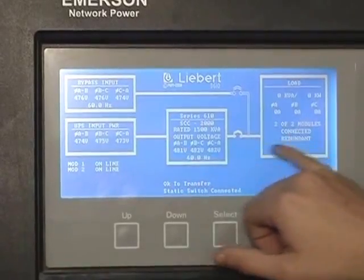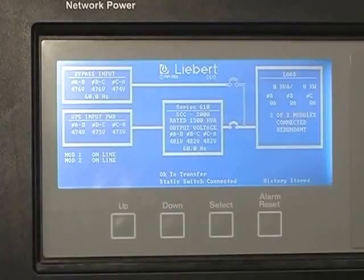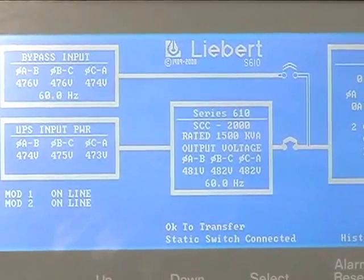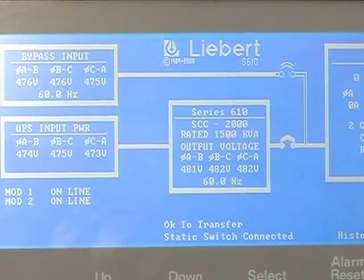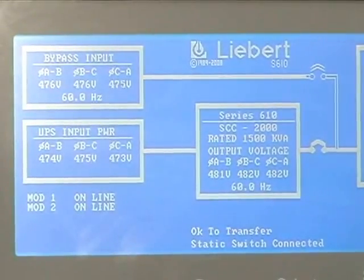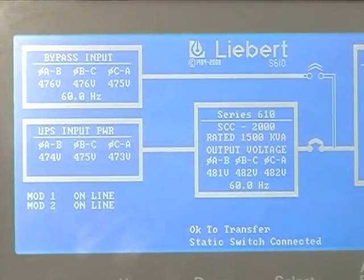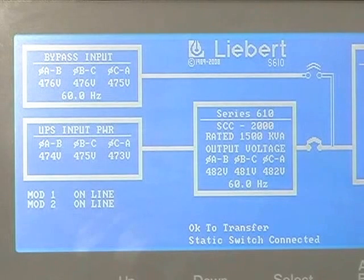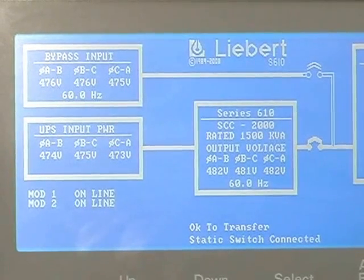We're going through the UPSs right now. If you see it going through here, that's your bypass — that's not good. You see the 'okay to transfer'? That means the voltage and the frequency are okay to transfer to bypass; in other words, they're synced. Now, if you see the module online — if we open a breaker on one of the UPSs, it will show off. So right now you're running on just one UPS and we're doing maintenance on one of them, or it's offline because it failed for some reason — like over temp. So that gives you a status. Go to UPS number two and look at what the alarm is and call us and say we've got a problem. Anytime either one of these systems is in alarm, it'll show up here as a system alarm and will tell you what the alarm is. You'll have to go back and look at the UPS.